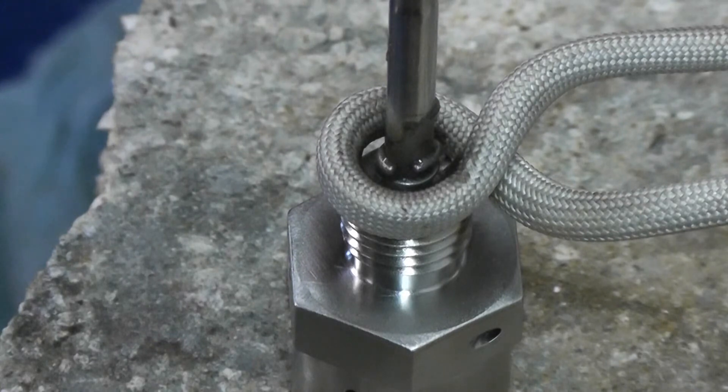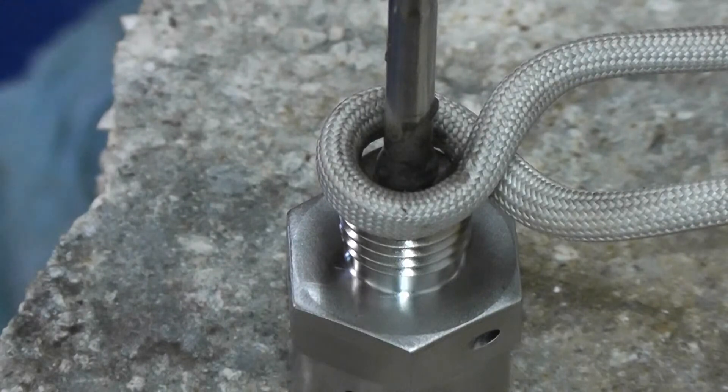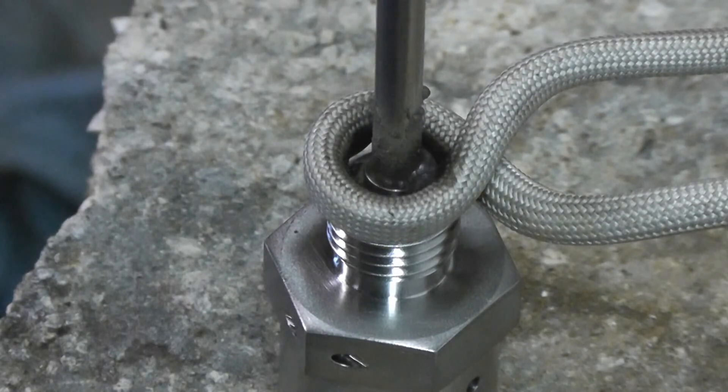I think this must be a different alloy. We tried running at the same 25% power level and it wasn't heating effectively, so we've raised the power to about 50% on the 3 kilowatt power supply. Power is on now. The part is brazed. Second brazing trial on the second hub, still running at 50% power — power is on, and the part is brazed.